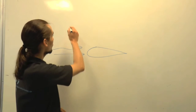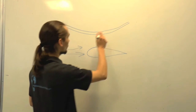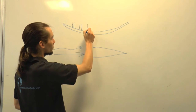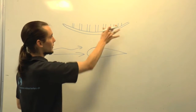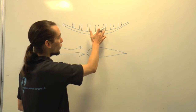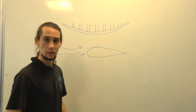But also, when we come to the curved member at the bottom of the structure, it's got a very skeletal looking structure. Because it's going to be head on to these lateral loads, the fact that it's got all these holes is going to again work to reduce the amount of lateral force affecting the structure.